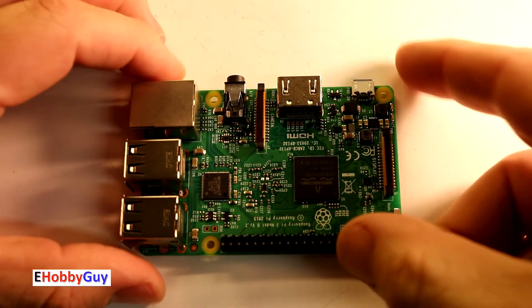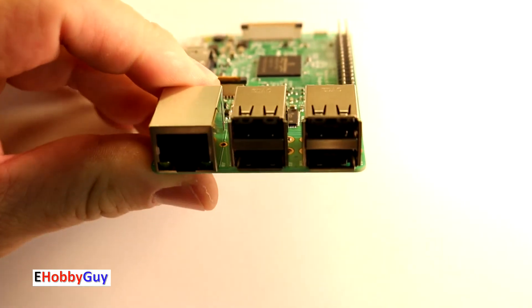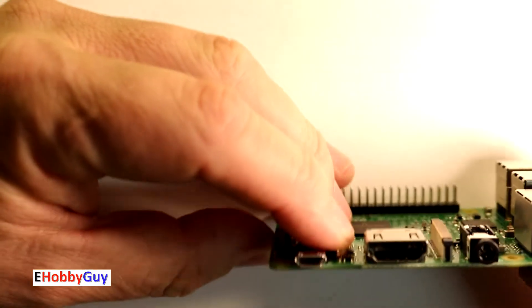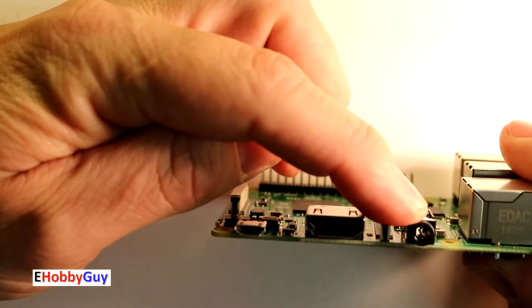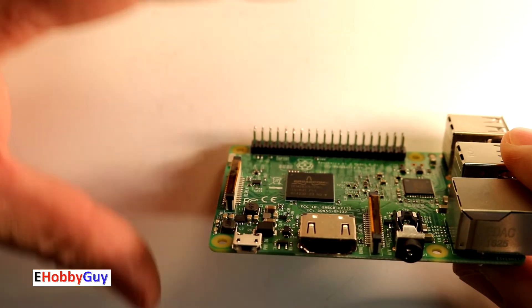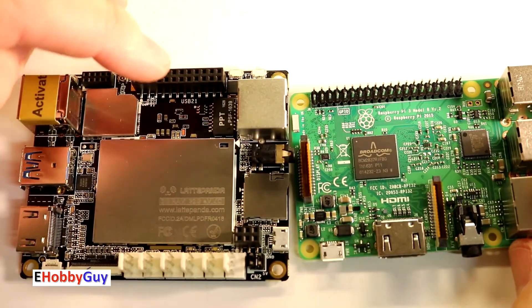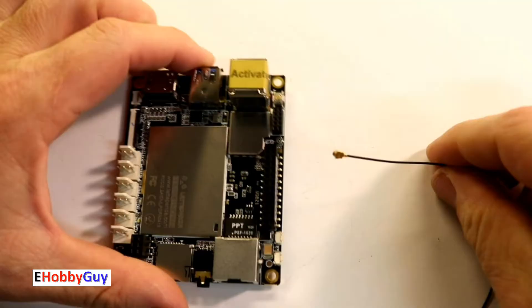A quick comparison with the Raspberry Pi 3: the RPi3 has four USB 2.0 ports but no USB 3.0, only one processor, full HDMI, and audio out configurable for composite video. The RPi3 has no onboard flash. Comparing the GPIOs, the LattePanda with its independent onboard Arduino processor is just coming out ahead overall.